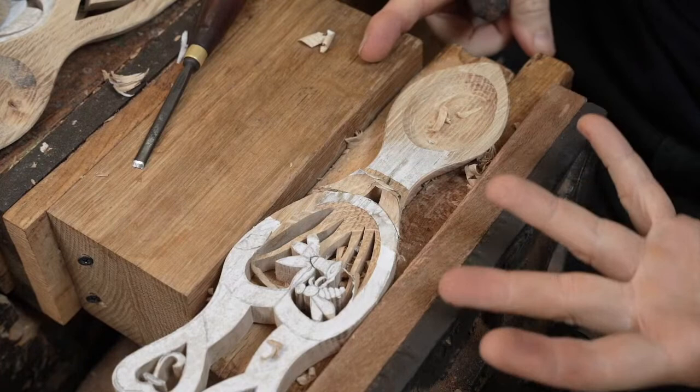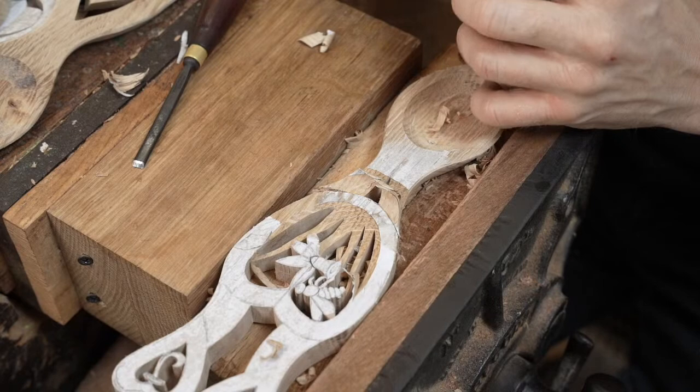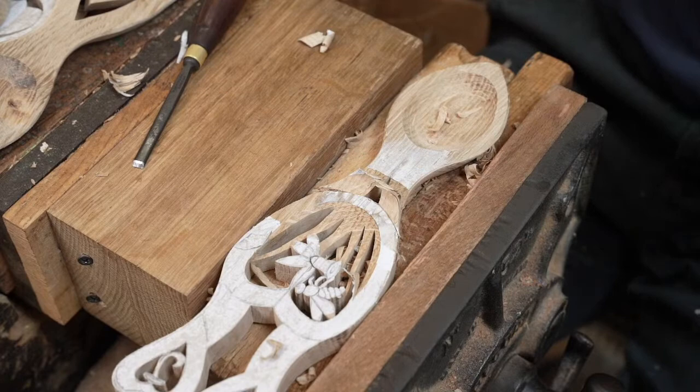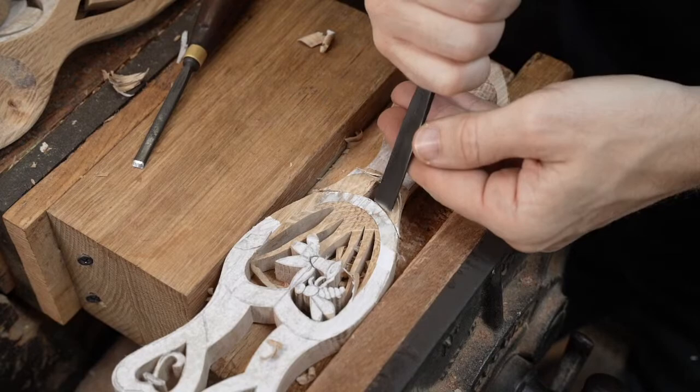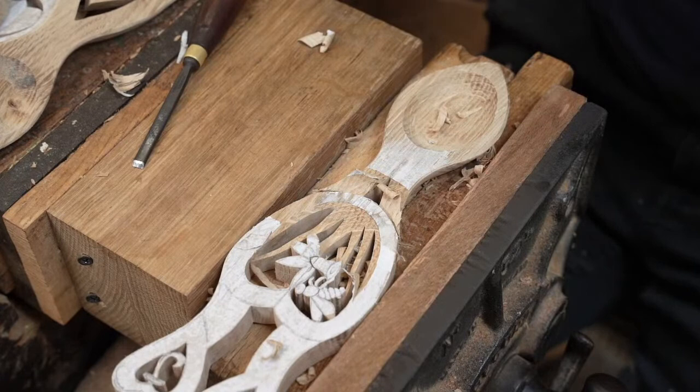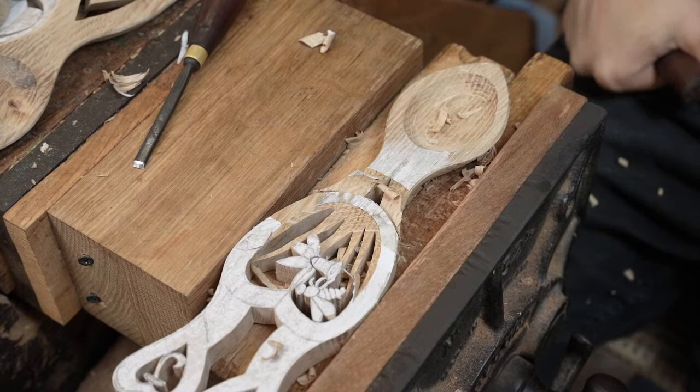Sharp gouge, so check your gouges. Could that be a tear-out there? What's that then? See that? Little bit on the candle? Yeah. Possibly. Yeah, tearing out on the grain. I mean, a couple of things. It's working with the wood, so if you're battling against it, that can cause tearing, that sort of thing. Having a good quality sharp gouge, appropriate wood, because certain woods, when you don't get a clean edge, yeah, it is carving across grain. So it's when you don't get a clean cut.